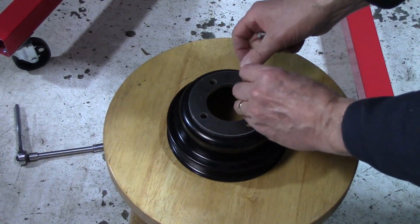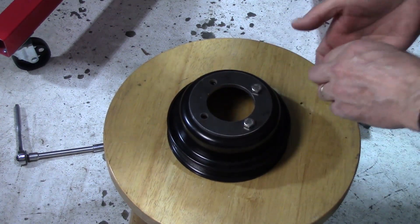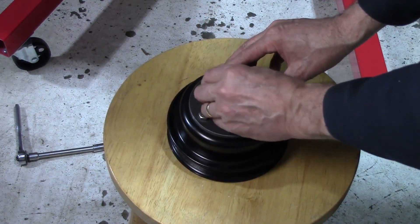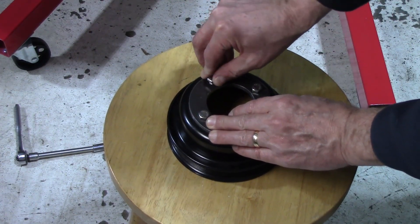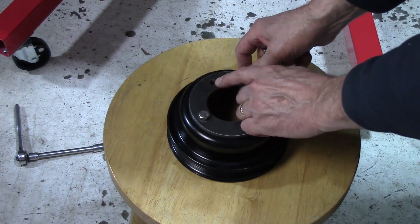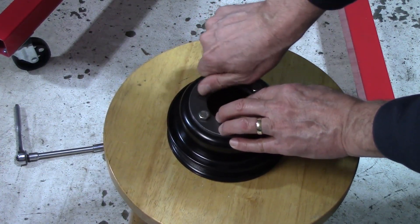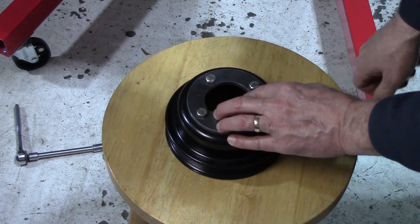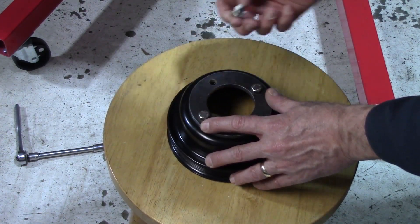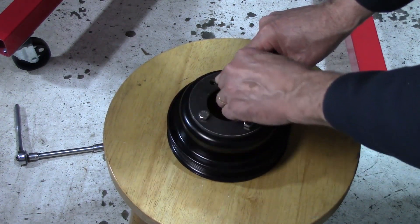Because I did it very unorthodox, I'm wondering if all my holes line up. There's a little resistance — that one is just a little bit off. I'm just going to take a Dremel and slightly open up that hole so this thing will screw down. It's almost the length of the thread so I can thread it down. I'm just going to get in there and open that bad boy up just a little tiny bit. The other three fit perfect.